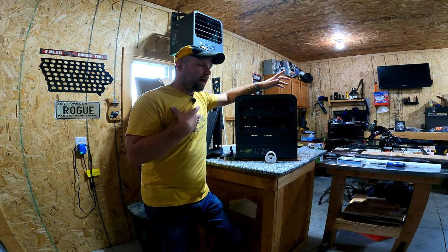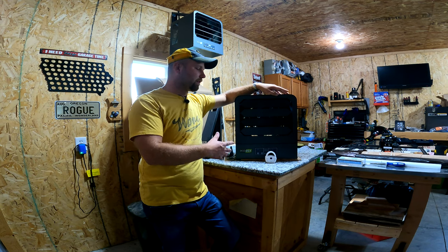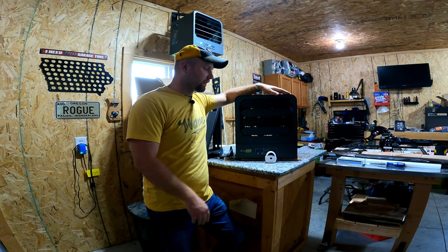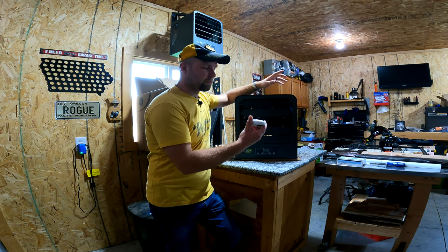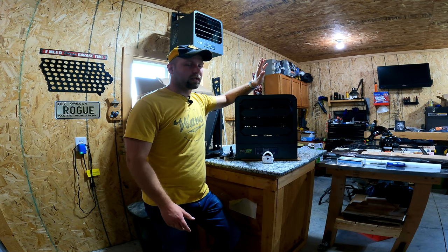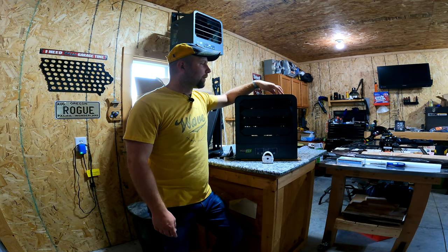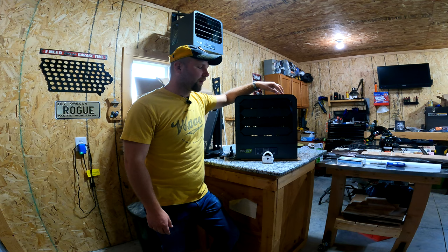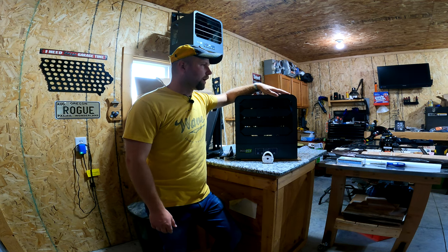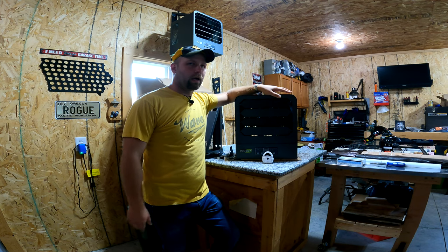If you're in the market for a new one and you like technology, I like to future-proof myself because technology is advancing so much. This is pretty robust technology and there's really nothing that's going to go wrong and prevent the heater from working. Worst case, you go back to the internal thermostat. I'll put links to King Electric's website as well as Menards where you can pick these up. This is a 7,500-watt two-stage heater. This is a 24 by 24 garage with nine-foot walls — I've got R13 in the walls, R30 in the ceiling, and an R8 garage door — and everything worked great all winter long.